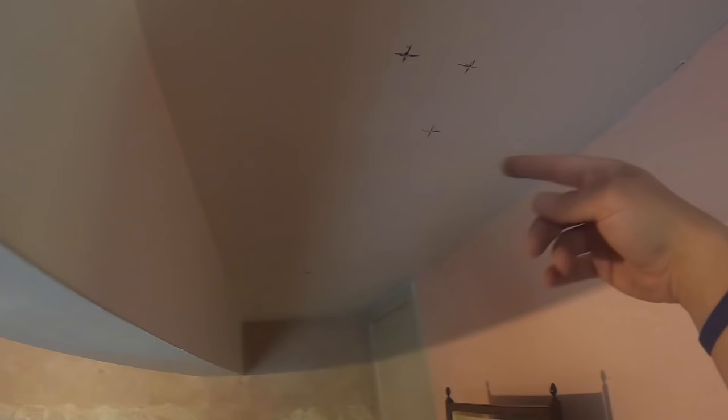We've got a main beam that runs down here, and you can see there's a slight crack here. That's the main beam down the centre of the house, so we've had to come 6 inches forward, 4 inches across to miss everything. So we've now straddled it. We've got 1, 2, 3 running down here. So that's 3, and then there'll be 6 in this area.